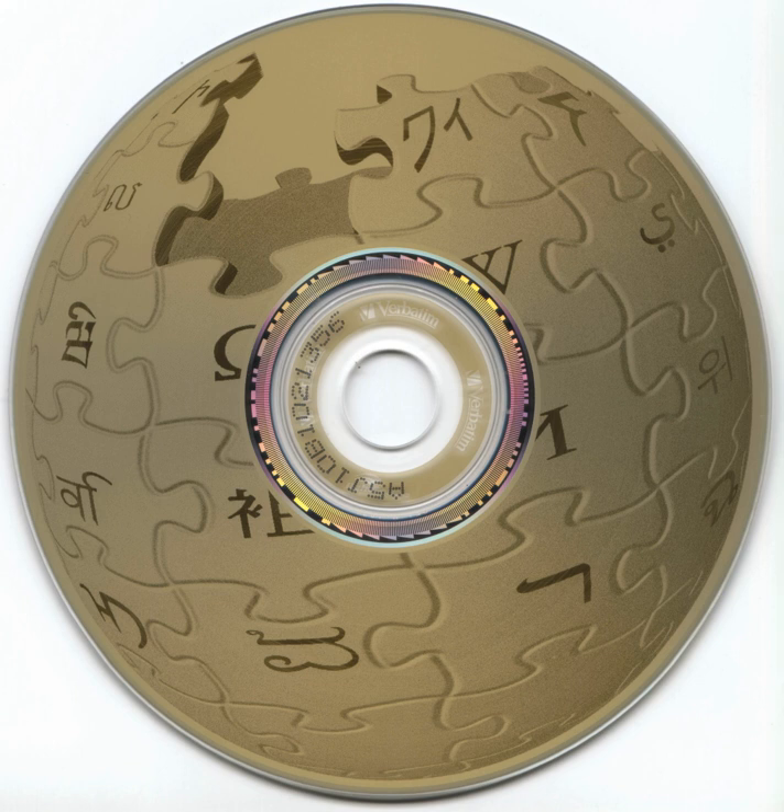A LightScribe optical drive was used by a UCLA graduate in 2012 to successfully turn a specially prepared graphite oxide layer coated onto a DVD into graphene. The researcher and his lab professor used an unmodified LightScribe drive. The disc was prepared by coating it with an aqueous solution of graphite oxide and allowing it to dry. Areas of the coating illuminated by the LightScribe laser were turned into graphene, and various shapes can be drawn, allowing the scientists to essentially laser-print an ultracapacitor on graphene using consumer-grade technology.